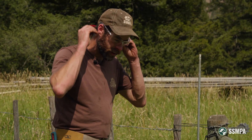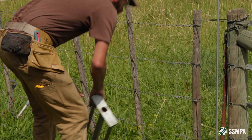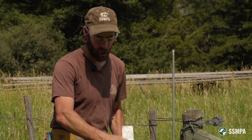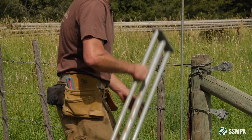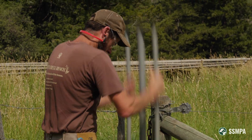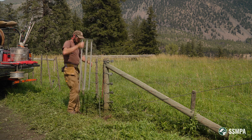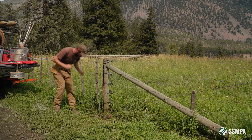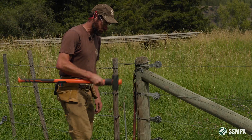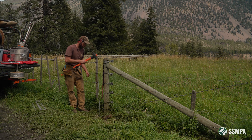You're going to want your eye and ear protection for this part. I like to start driving the ground rods with a post driver — this is a nice small diameter post driver for Gallagher line posts. You can use that to get it started, drive it down until it hits the ground, and then start using your sledge. If all you've got is a sledgehammer, it's a little harder to start up high, but sometimes I'll stand up on the tailgate of a pickup truck.